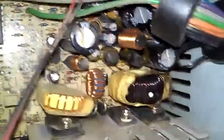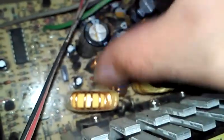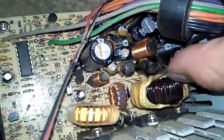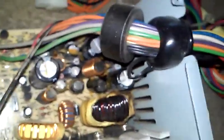I have never seen coils so cooked before. Look at that — these coils are completely toast. This is the inductor for the 12-volt, and 5-volt I think, the 3.3-volt inductor, and standby 5-volt inductor maybe. Look how dark those wires have gotten — there's been some immense heat. Seems like it's been driving a really big load.